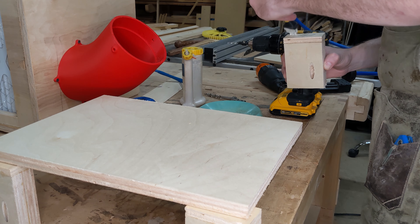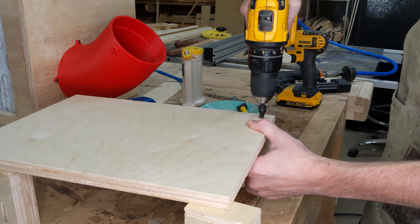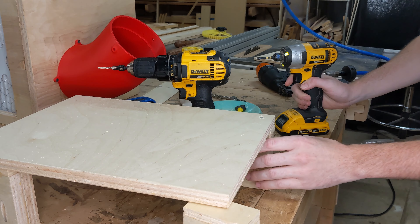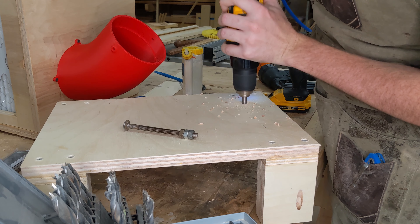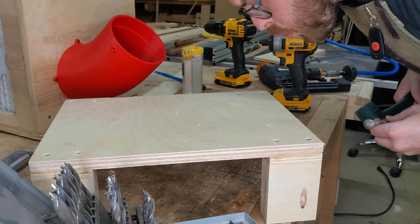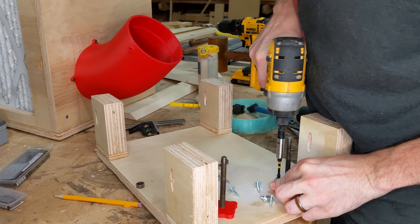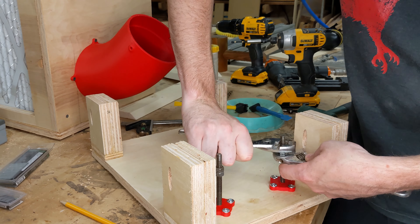The dimensions of the box and its proximity to other things that are already on the wall meant that I was gonna have to get a little creative with how I mounted it above the impeller. I knew there would be a little bit of space between the box proper and the wall, so I made some sort of platform to take up that space, and a couple of solid wood cleats to get it into position. I also thought it might be a problem with this heavy of a box settling onto the impeller, so I modeled up and printed off some parts to preload the setup off of the dust collector. In the end, I also put a screw through the wall mount so there's no chance of it moving or falling off.